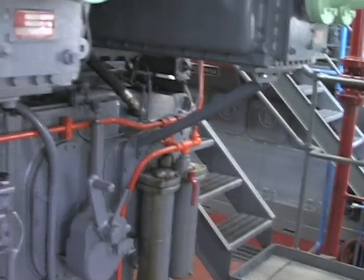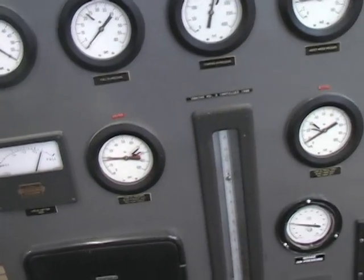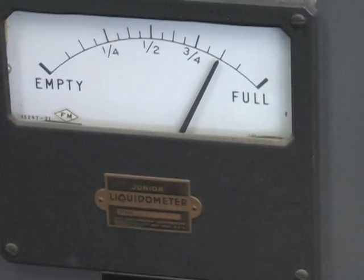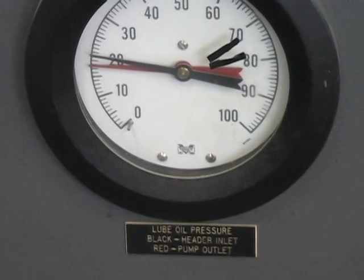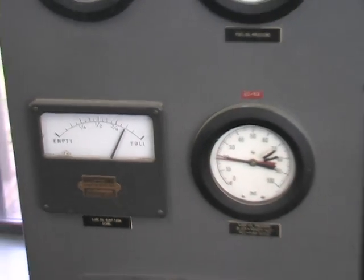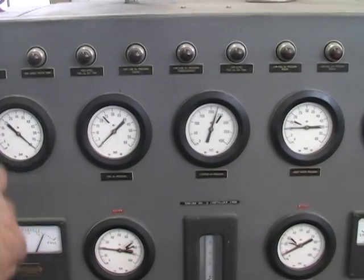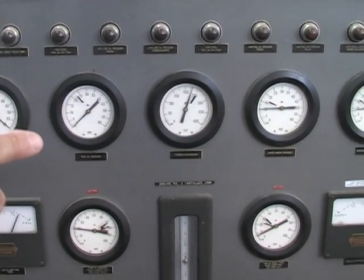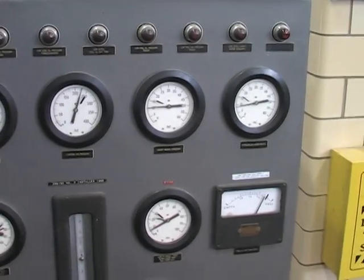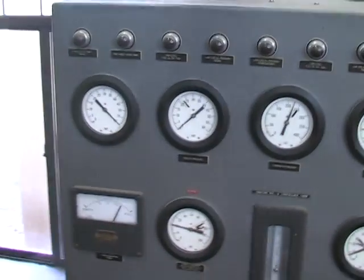Right now I'm going to put the air supply on, I'm going to start the engine — right there it is — and then I'm going to watch the gauge panel here. I've got lube oil pressure ready, and that's the one with the red handle on the psi, and lube pressure. Put on fuel oil — fuel oil pressure will come up when the engine starts. Ejector pressure means the water is being circulated, and I've got an intercooling water pressure, then the water cooling is going to be running for the turbocharger, and that turbo's up.